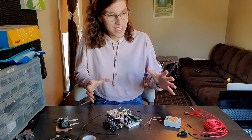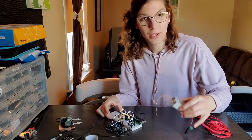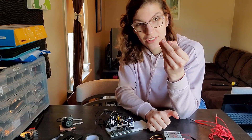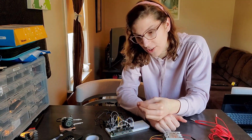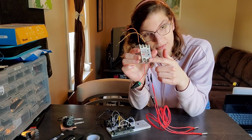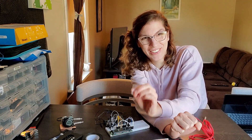Okay, so we did it — it's been two weeks but we've made a ton of progress. We've successfully got a temperature sensor going and hooked up the heater circuit. All that's left for two-thirds of it is to connect this to the board in a way that can be turned on or off. The easiest way is to use a transistor — a little thing right here that acts as a voltage switch. It reads a small input signal from the Arduino and outputs a five-volt signal to the relay, which triggers and turns on the heaters. To turn off, the Arduino removes that small signal to the transistor, the transistor turns off the relay, and we no longer have voltage. I'm really, really excited — let's do this.